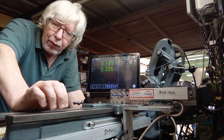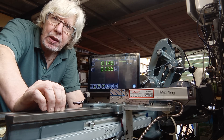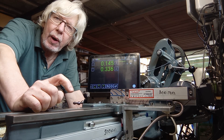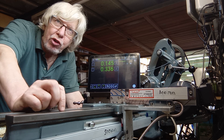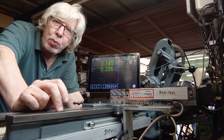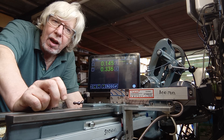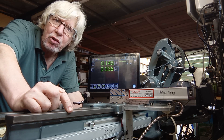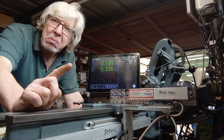I'm going to do another video. I've fitted a motorized lead screw to it with a windscreen wiper motor, which I've already done on the mill and that seemed to work alright, so I've had a go at doing it on the lathe as well. Although I have got a Clough42 electronic lead screw kit, which also does thread pitch so you don't have to use the change gears, I haven't got that wired up yet. I just wanted initially a simple motorized feed so I could get a better finish on the jobs I was doing. That also allows me to have electronic end stops with micro switches so it doesn't overrun either end. I'll show you that in another video — I hope you've enjoyed this. See you again soon. Cheers.